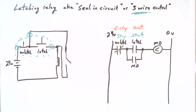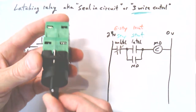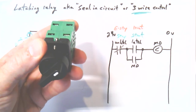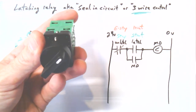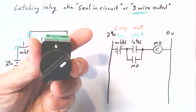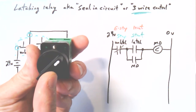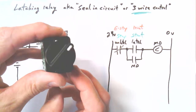And that will happen if you had something simple, like remember when we just had our circuit for this activity, let's say you have the motor running forward, okay? Now you lose power to the machine. Power fails, blinks off or something. So, okay, your machine's down. You go grab a broom to do some cleanup or whatever. You're doing some cleanup on the machine when all of a sudden power is restored. And look, that machine is going to jump back to life. So if it's a big saw blade, for example, that's bad news, right? That's going to surprise people.